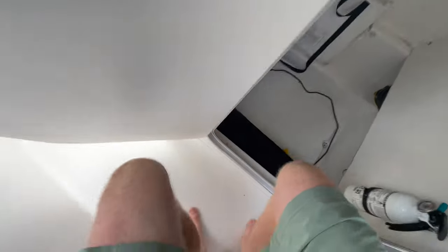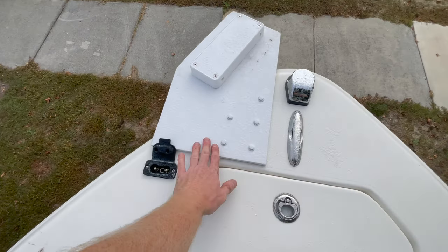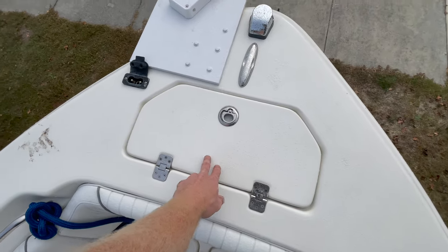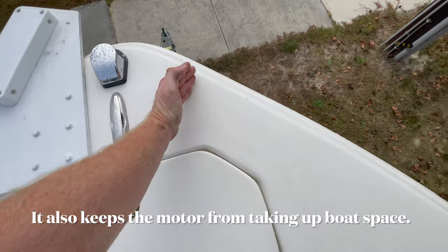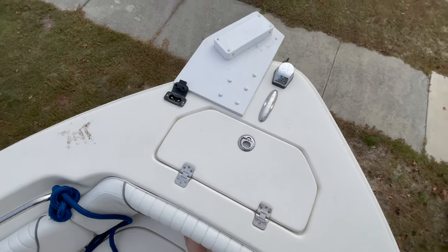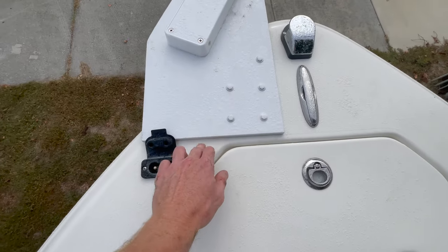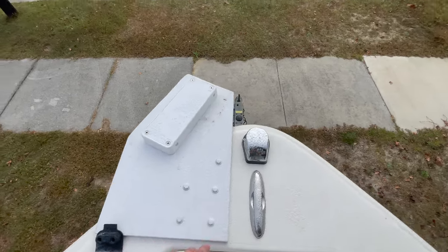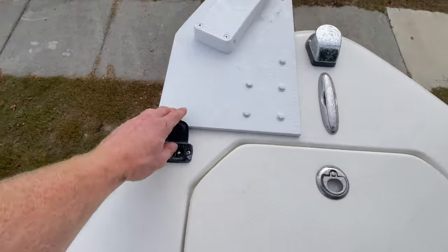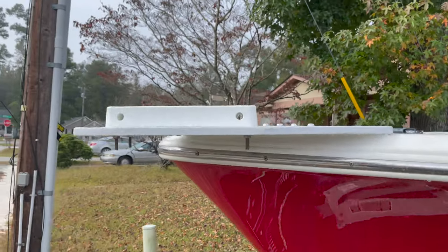Walking up to the front of the boat, I'm going to show you guys what I had to do to get the trolling motor setup set up. I have a trolling motor mount now. I made it because I didn't want to cover my anchor hatch whenever I had the trolling motor out — if I'd mounted it right there I wouldn't have access to my anchor. This is half-inch aluminum and underneath the deck I have a quarter-inch plate mounted there. This is the upgraded quick-release bracket — it wouldn't let me use the former one from my old trolling motor. I also hooked up the battery tender so I can plug straight in.